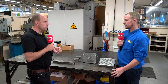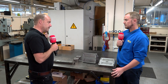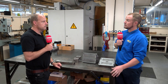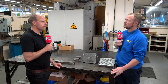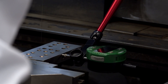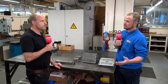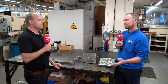So does it get to a point where you can't machine these? And if so, then it goes on to the EDM side, the spark side? There are some limitations to what you can do with milling. Obviously, you're limited to the tool that you can use, and that is the greatest limitation to speeds, feeds and efficiencies. Classic example, we go down to about a 0.2 cutter, but rarely. 0.3 and 0.5 are our bread and butter. This is obviously going to leave radiuses in corners. Some of our parts need to be sharp edges, so that's when we will produce electrodes, again on these machines, so we can spark out pockets, cavities, create sharp corners.